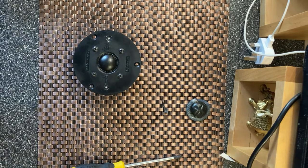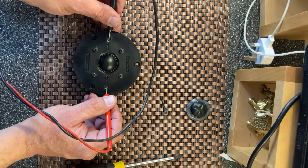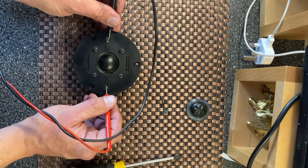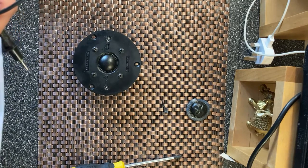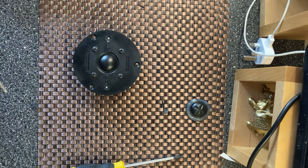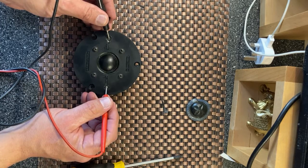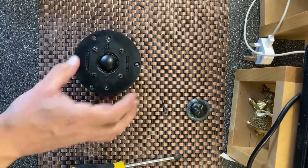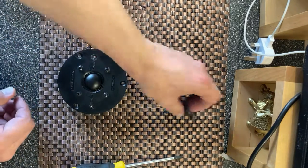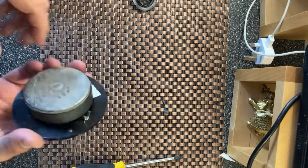So there should be a circuit even on these top bits - which there is. If that's meant to be a four-ohm dome they're way out - that's 8.5 ohms. Let's see if it has a description. It doesn't, but I'm a hundred percent sure that an HF-1000 - yeah, I mean that's reading nearly nine ohms, 8.6 ohms. So it was done, but how accurate those domes are is anyone's guess.